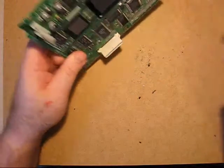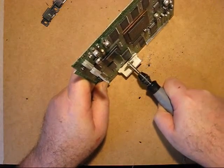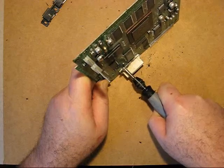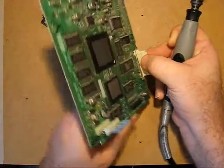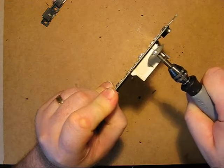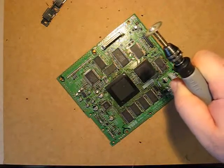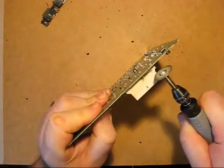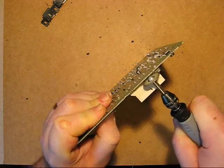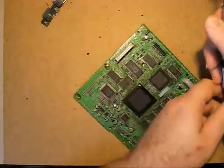Start again. Start to feel when it's cutting to the metal. Work in good stages — don't do it all at once, otherwise it could end up cutting more than you want. You don't want to go too far down onto the board because, bearing in mind the Dremel is at a sharp angle, it could actually damage it. So again, hold everything rigidly. Just turn the speed up on the Dremel a bit. Keep a close hold of your Dremel, because it does tend to flip.